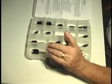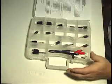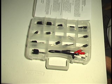Run only as much signal level as it takes to do the job. In other words, don't overdrive it, or else you could potentially get crosstalk, not due to the cables necessarily, just due to signal levels. Run only line or earphone level signals. It's not designed for microphone and not designed for speaker level, just earphone level.